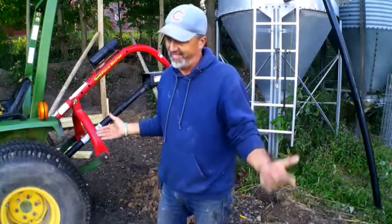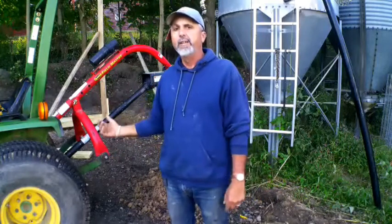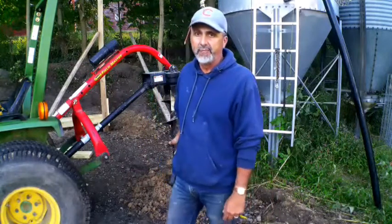Ask me how I know this. Go down, come up. Go down, come up. Just keep cleaning the hole out. Go farther, farther, and pull it. But don't just auger. Because if that thing grabs, it's going to take it right down. It'll kill your tractor. Then you're going to spend another hour hand digging to get your auger out of the hole. Like I said, ask me how I know this.